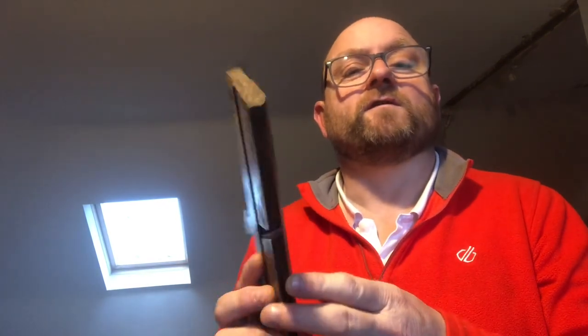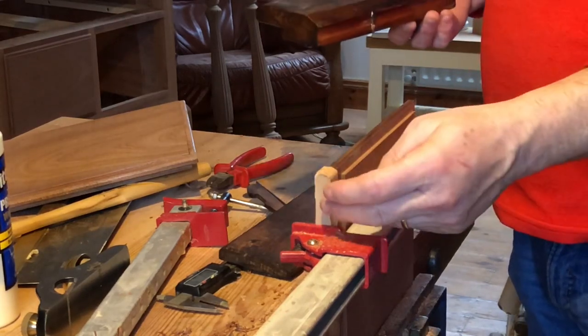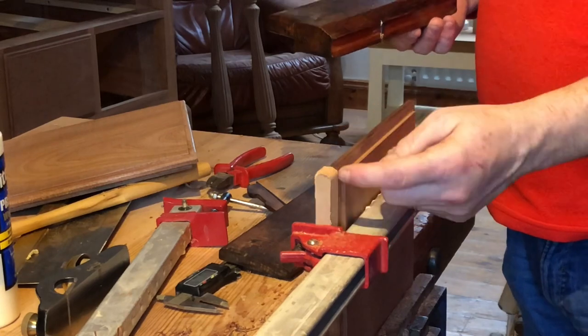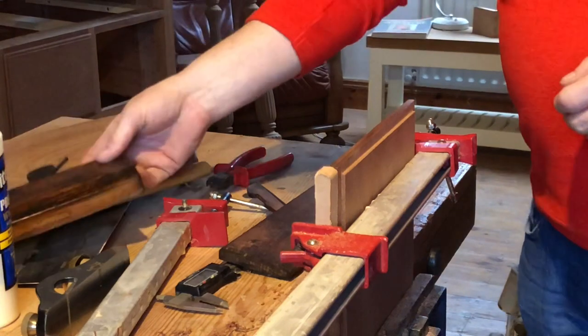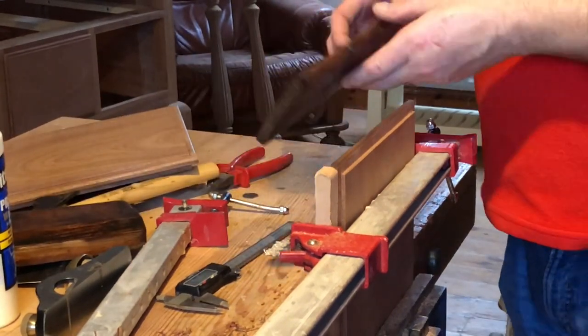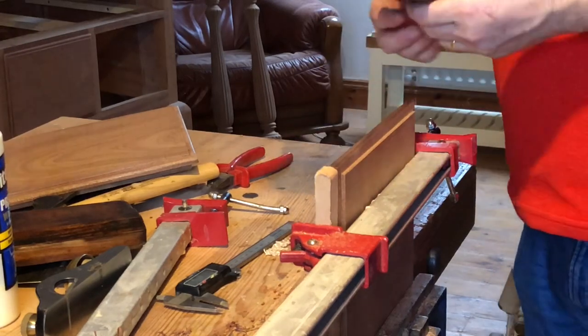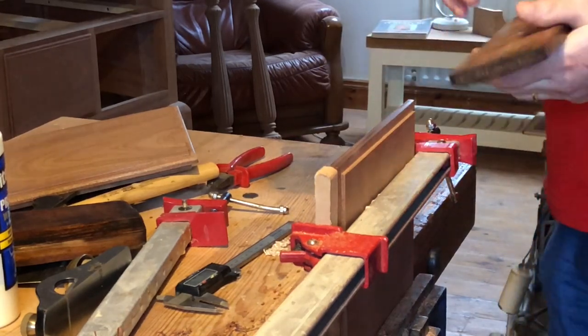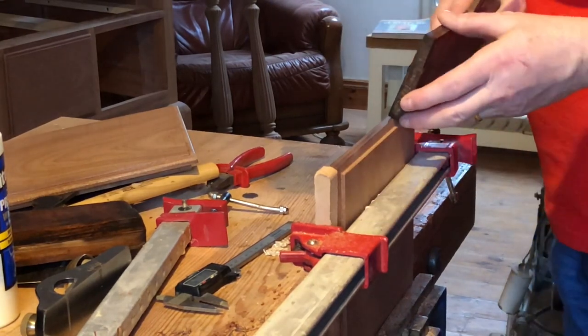You can see it's a very, very small hollow — you can just make it out. Anyway, what you're going to see is I put a false block, which is a piece of MDF, up against the end grain so we don't get any blowout. The next thing we'll do is take the hand plane in question — the number four, five sixteenths of an inch skew hollow — and we'll make our first couple of passes.